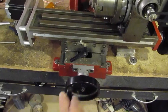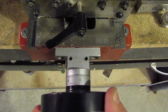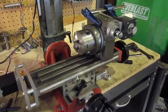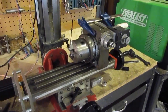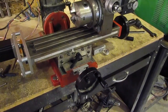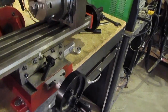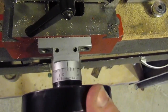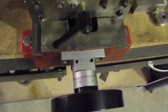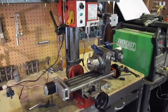It's got these two cranks — one goes one way and the other goes the other way — and on these cranks you've got very accurate increments in thousandths of an inch. I can bring it into a very accurate position. On the table I can hold a piece of metal in a vise, or in this case I have a rotary table set on there. It's really accurate, but when you need to move the table two inches you've got to turn the crank 32 turns. And if you need to move to a certain measurement like 2.136, you've got to turn to 62.5, then reset to zero and do all your math adding 62 and a half over and over. It's really confusing and I screw it up all the time, especially if you have multiple pieces to make.